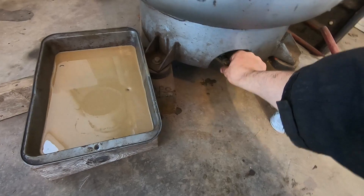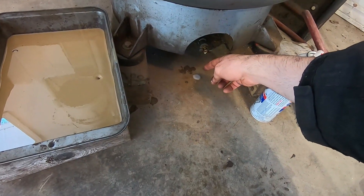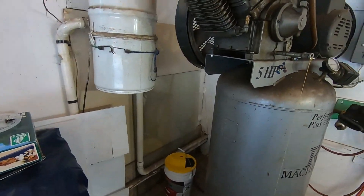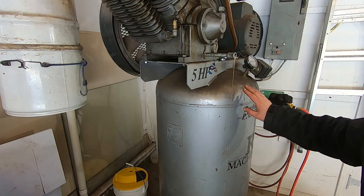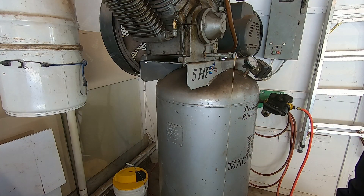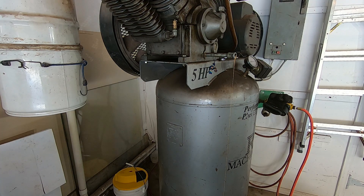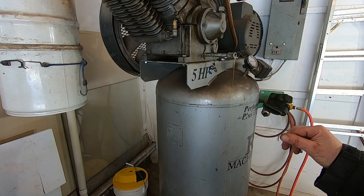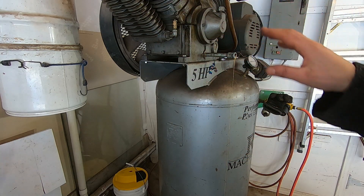Drain the bottom of the tank — and of course there's a little bit of water coming out there right now. If you use your compressor in any kind of humid weather, it is going to collect a lot. That's something I drain at least once a week, and if I'm using the compressor a lot every couple of days, I'll get maybe a cup or two of water out of the bottom. Just never let it build up — if you're diligent like that, the tank will last a long, long time. Those are the main items for maintenance. You can get into overhaul procedures dealing with valves, rings, and all that stuff, but that's not considered maintenance. If you like my videos, please subscribe. Good luck.